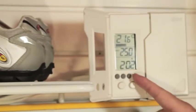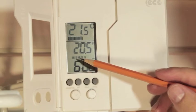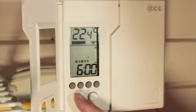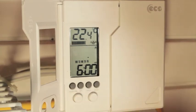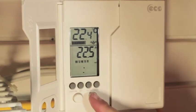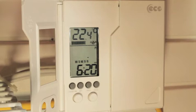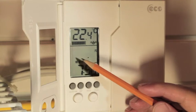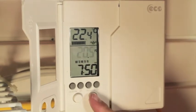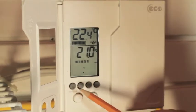To begin entering the program to the thermostat, press PROG once. The symbol for Program 1 will appear on screen as well as all the letters for the days of the week. To adjust the temperature of Program 1, press the arrow buttons. To switch to adjusting the time, press the usage time button and the time will now flash. This can also be adjusted using the arrow buttons. To switch between the temperature and time, press the usage button — whichever you are about to switch will be flashing on screen. To advance to Program 2, press the PROG button. P2 will now appear on screen with all the days of the week. You can adjust the temperature and time the same way, switching between them by pressing the usage time button.